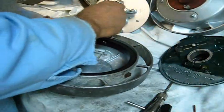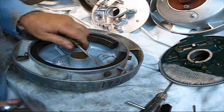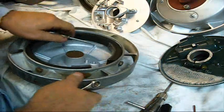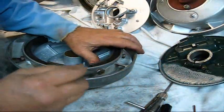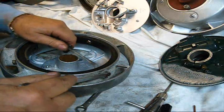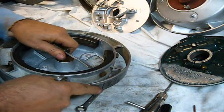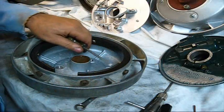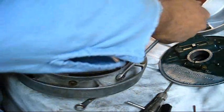That's going to be the shop tip for today - maintain that setting. That one right there is not correct, so if it ain't right now's the time to set it right. Get it around there where you can hold it - it will save you a boogered up screw head. I like to tighten the middle one first, then come around and do the other one, then come back and get the opposite one, working towards the gap and lock that in.